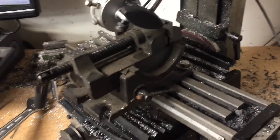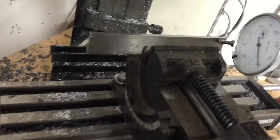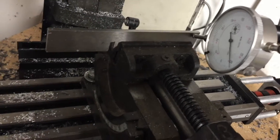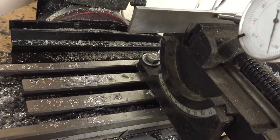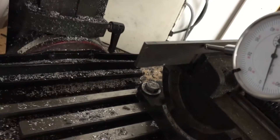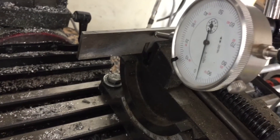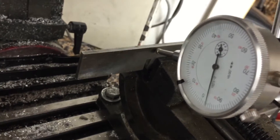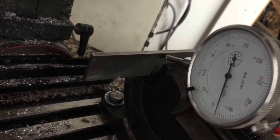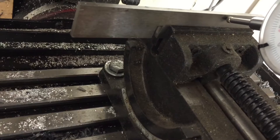Now I'm putting this other vice on here because that crappy one down there is horrible. I forgot I had this thing sitting around the shop for years and never used it — got it free from somebody. I'm going to get this thing squared up. I have a parallel sitting in the vice there. I've already squared it up pretty close on the fixed jaw and ran it across, got it within a thousandth of an inch. Then decided to do something precision. So I've got the parallel on there — let's move this across and see if it changes. Zero out our deal.